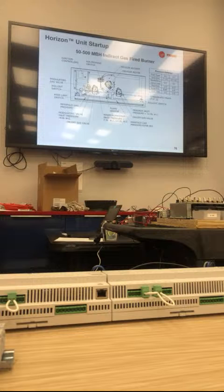Sometimes I go too far trying to calibrate it, and then it goes into flame failure, and I have to re-clear it and try to fire it back up before it shuts out. What I do in that case, if it starts off too low on the minimum fire and you watch it drop out, is increase it all the way up to about 0.6 inches. Before it tries to retry, I keep pressing the up button until it's fine, and then I release it before it goes back to the next try. If you lose flame, it doesn't kill power, so you can keep hitting the increase button until it relights, and then your pressure will be like 2 inches, and you just decrease.